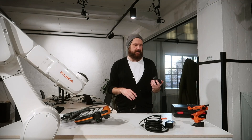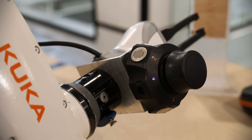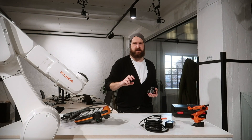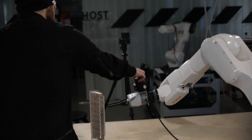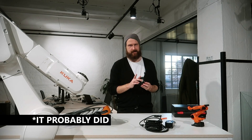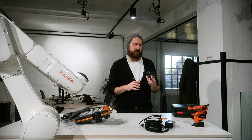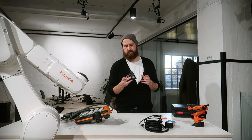For me the main element of the Ready-to-Pilot 2 package is the external six axis mouse. We can mount this on an end effector or the robot itself and then program it to be an immediate way of manipulating the robot and programming. Unlike the original one — which I've never used to be honest — I don't think it had buttons, whereas on this edition we have two buttons, one and two, that we're able to program. We can use any global variable in KSS and KRL and set it — say if we want to move to a location, record the position in LIN or PTP.